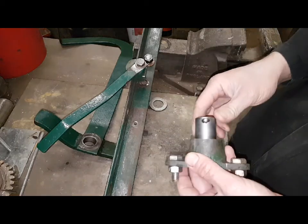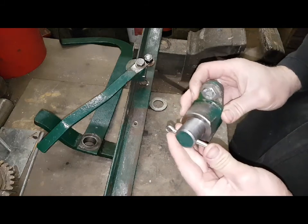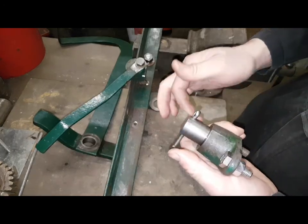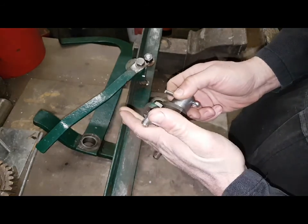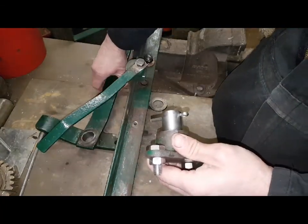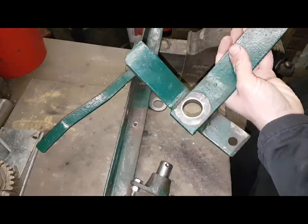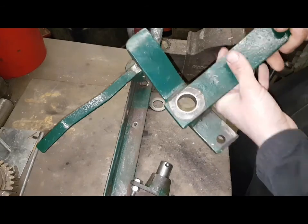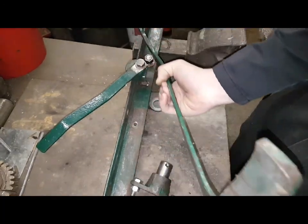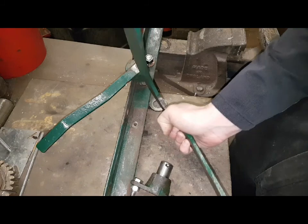Now we've got this done, it's turned out quite nice actually on the lathe. Got a good pin, that proper good fit in it. We've trued this up, this bolts to the tractor, and then the clutch pedal goes on this. Since I've pressed the bushing that I made, just to true it up, like, you know, what happens with these, the bouncing of the engine and the years of work, the pedal, instead of being straight up like that, it ends up leaning like that and floating around.